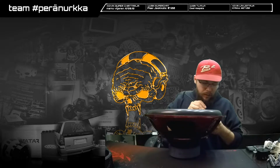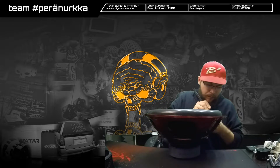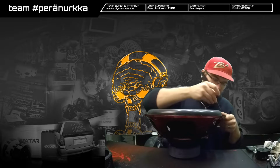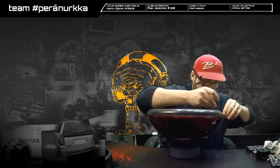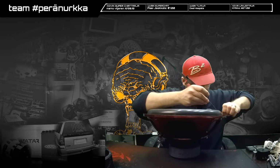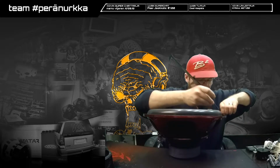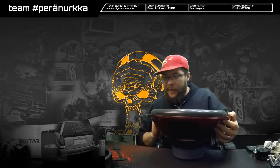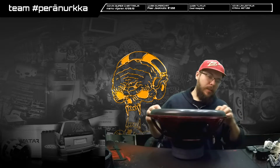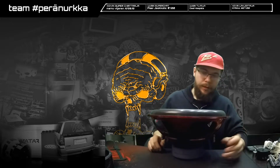Now the top surround is glued with a very tough but slightly rubberized glue. It is actually very rigid or stiff glue, but it flexes and bends. I have a small drop here that I try to peel off, and it really is really, really tough glue. It is flexible, but really tough glue, really good glue for use on the top surround. And the bead here is quite wide. It goes quite heavily all around. You don't see it because it has the ring on it and it's all fully transparent.